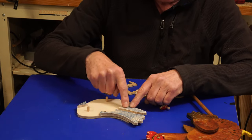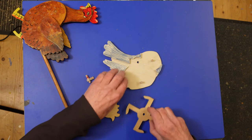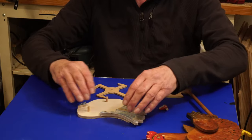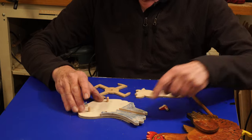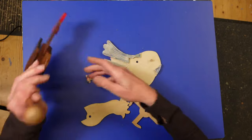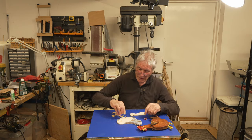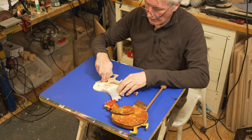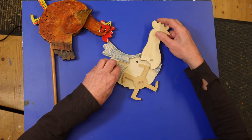We glue these parts on — I've coloured them blue to show that these parts need to be a little bit thicker than the plywood, so that the parts inside can spin. Either you need to stick a thinner piece of plywood on top, or find some wood that's a little bit thicker to make those parts. This channel here needs to be the same width as the dowel you're going to use for the handle, so it'll just push in. Glue those sides, let them dry, push those two dowels in — they need to be the right length so they just go to the width of the body. The feet go on this first dowel, make sure they spin right, and the head goes on the second one.